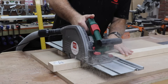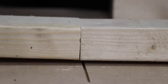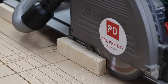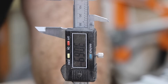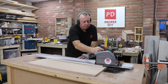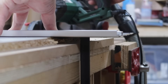I cut through a straight piece of three by two on the flat to check how square the blade is to the base plate, and using two methods I conclude it's as close to perfect as I can see — no adjustment required. I set the depth of cut to 30 millimetres or just over, then check with my calipers, which comes out to just a hair over what I've set — but close enough to rely on for setting depth adjustment on standard cuts. I also try some quick clamps that I bought for the rails, which fit nicely in the rail underneath and hold it in place on the workbench.